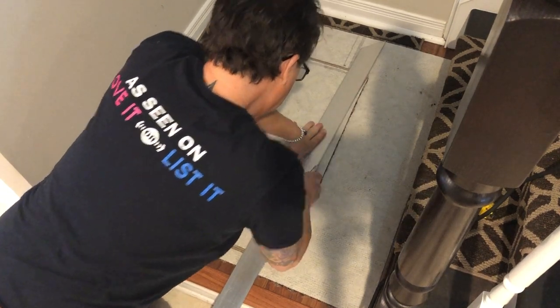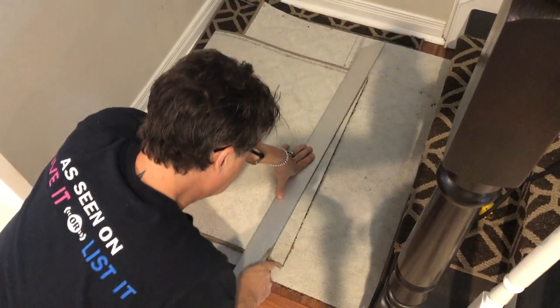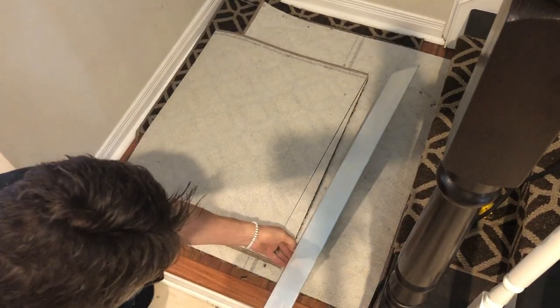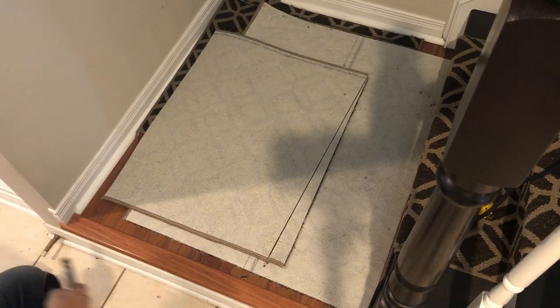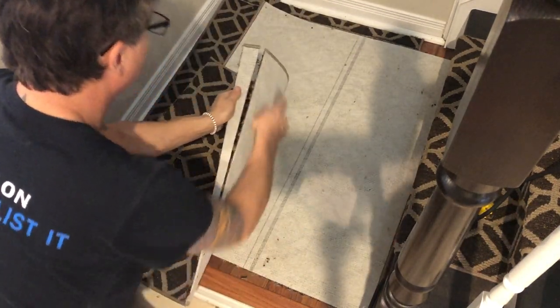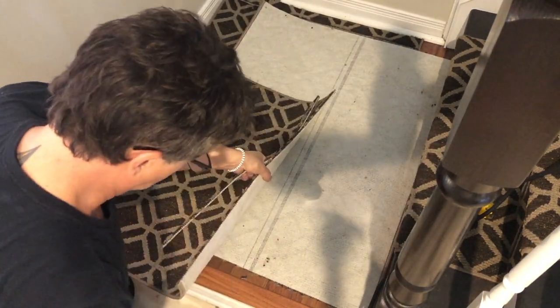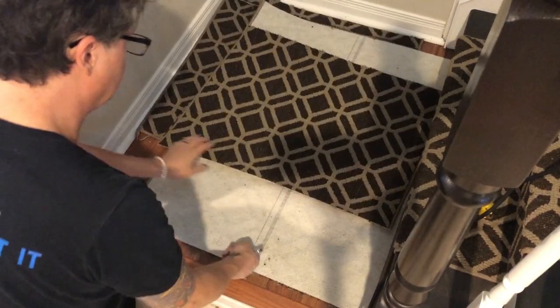There, you get a better view of this cut from the last cut. You can see that angle that I'm cutting it on. That's the whole secret, really. That's not for every staircase, but for this staircase, we can get away with it. Like I said, any staircase that requires over 2 inches, you're going to have to template it, pre-cut them, pre-sew them.